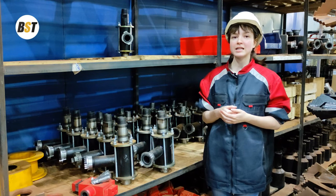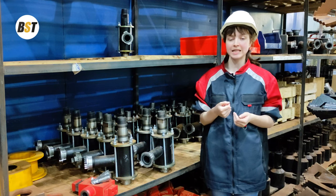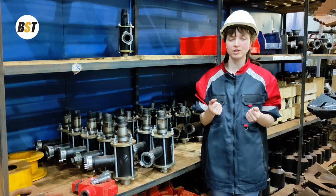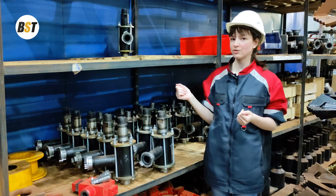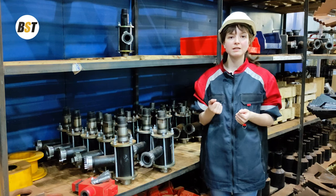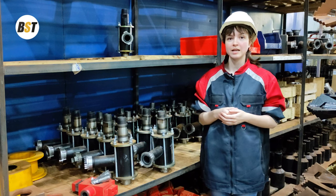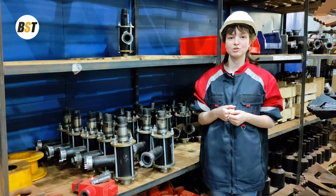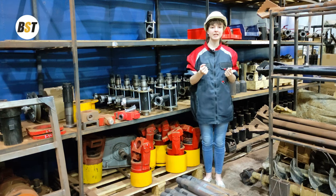The swivel is a mechanical device that supplies water when you perform wet drilling and air when you perform air drilling. You can see options with different suitable inlet diameters. When you perform air drilling with the help of a compressor and a down-the-hole hammer, an air bearing unit is used.